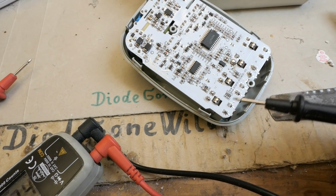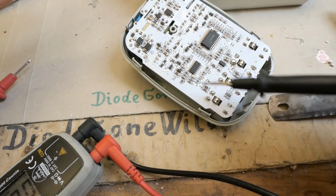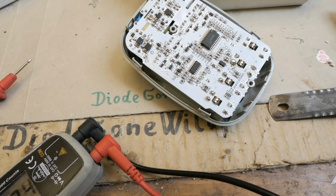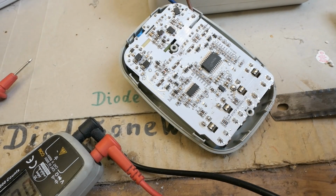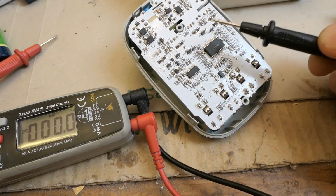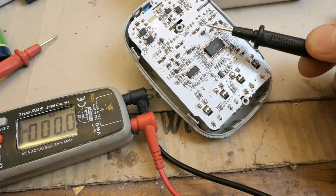It seems to be a 2-second cycle where each of the batteries is connected to the charging current for about half a second. So each battery is getting about 25% duty cycle. And those MOSFETs in the 6-pin packages are probably switching the batteries.